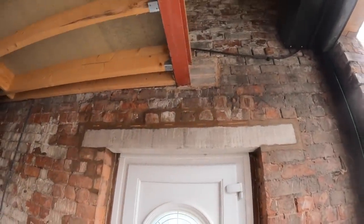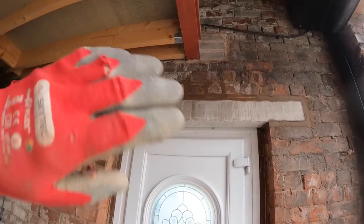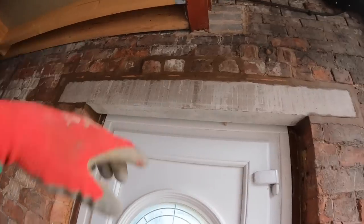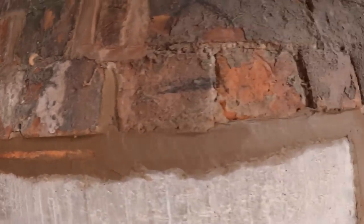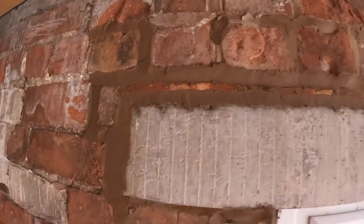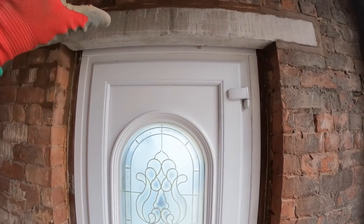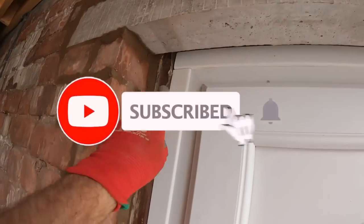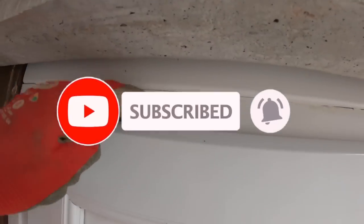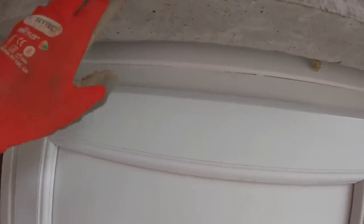We prop the steel up, just to take the weight of the steel off. Put a couple of acros across there. There was no need for that whatsoever, because these headers, that row of headers there, was obviously headers, so they're through into the other skin. So they were supported. We took out the 4x3 lintel. We dropped it, of course, rather than going up, because the door finishes here, so there's still a good 3-inch gap over the door. So we've come down, of course.